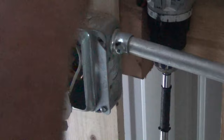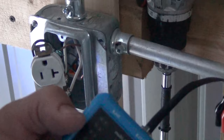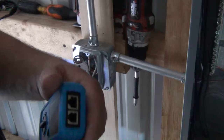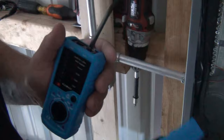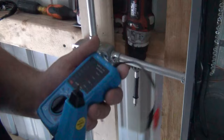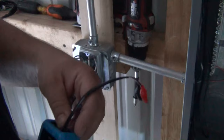Remove any electrical tape if there is some. Now, this is the tool I was telling you about — a tone generator. They use it mainly for ethernet cables. Some people comment that it's only for ethernet, but you can use it to trace any wire — it says so in the directions. You just have to make sure there is no power in the wire whatsoever, which is why I recommend turning off the main breaker.